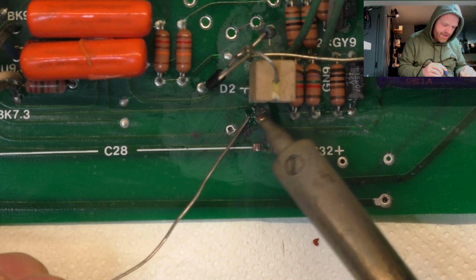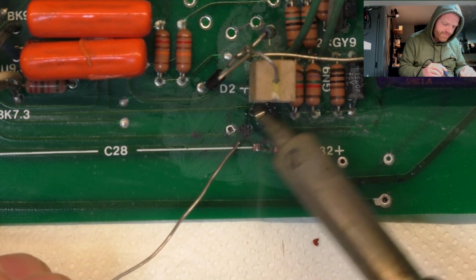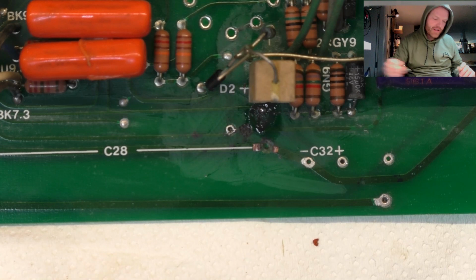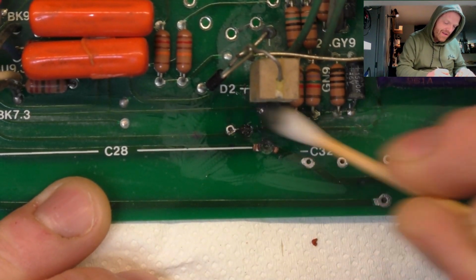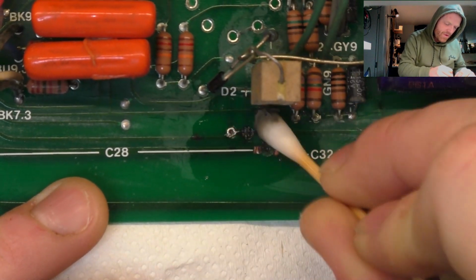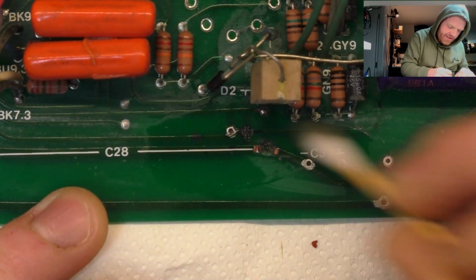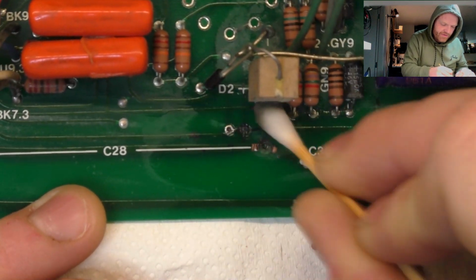So you can't even see the pad because you've got to heat up and remove the contamination first. Now it's just got this grey sludge that comes out of it and then goes rock hard. You've got to clean it off to see if the pad still exists or not. So whatever chemical it is, it actually leaches its way into the solder, not just on the surface.